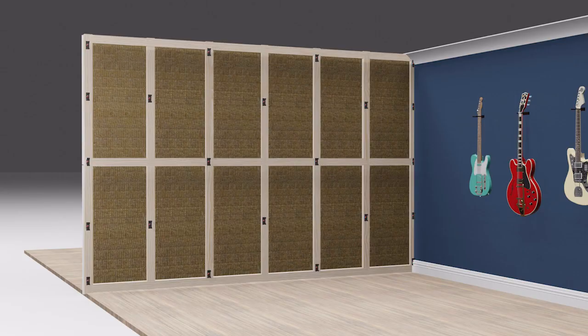Because we have a single point fixing, you only need one mark per row, making our system simpler and faster to install. Mute clips around the perimeter need to be no more than 100 millimeters away from the adjacent structures. Each row of mute clips needs a vertical spacing of up to 600 millimeters. To create the diamond layout, alternate the second mute clip position between 600 and 1200 millimeters away from the first perimeter fixing row — this gives you the staggered layout. Thereafter, space the clips up to 1200 millimeters from each other.